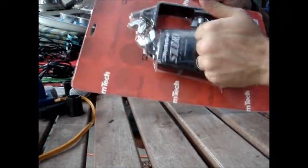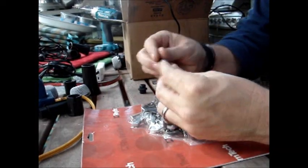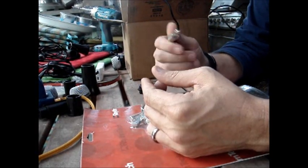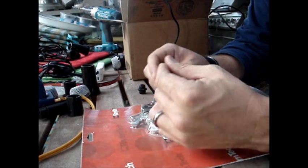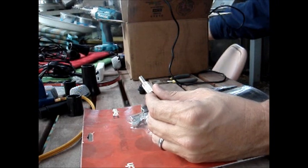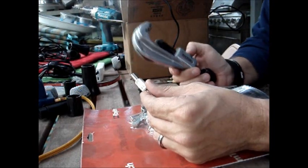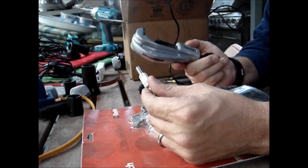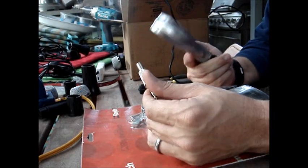For the cowbell, I like the Rhythm Tech Studio that comes with a versatile mount. You'll need a one-quarter mono plug to put on the end of the cord after you cut it and make it into an adapter, a soldering iron, a hot glue gun, and a pipe cutter — very handy. I'll show you how I use that; there are lots of different ways you can do this, but this is just the way I've found to be the easiest.